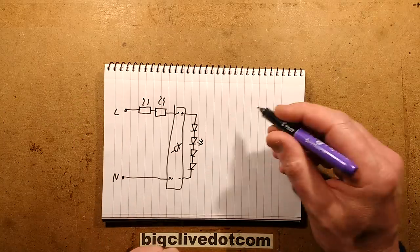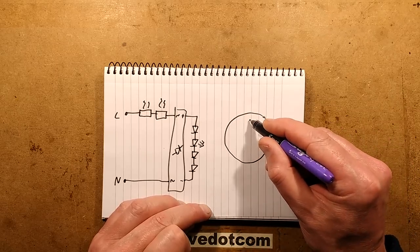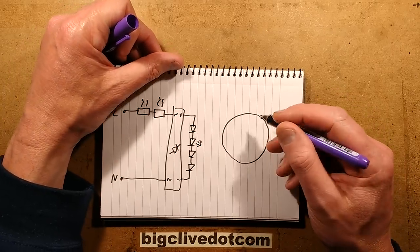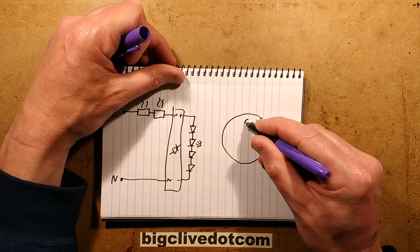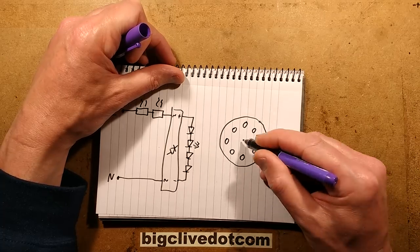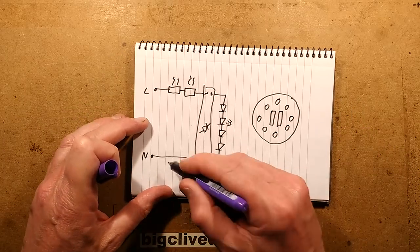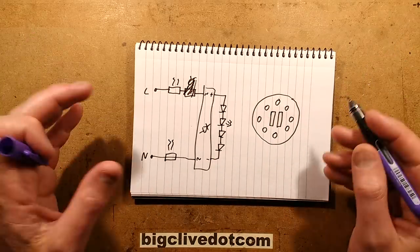The idea was to have a circular printed circuit board, keep everything well in from the edge — I was concerned about the fact that this is going to be a metal enclosure, and I didn't want any live connections near the edge that could bridge onto the metal, because most of these cases are not earthed. So the idea was to put lots of LEDs, as many as I could squeeze in around the outside, then have a couple of resistors in the middle and wherever I could fit them, fit the rectifier diodes. In the end, I ended up with one of the resistors in neutral and one in live, and instead of using a full bridge rectifier in a single component, it turned out easiest just to use separate diodes.